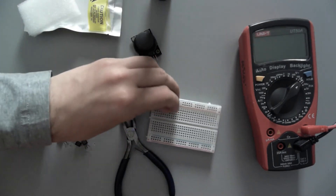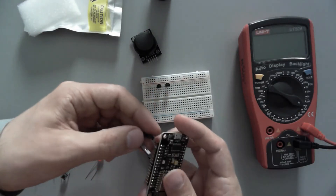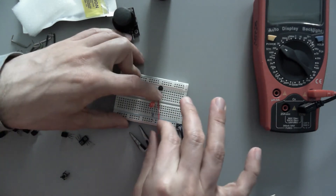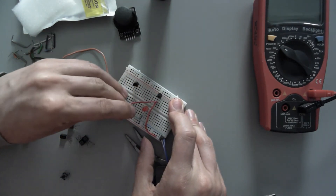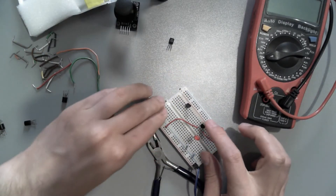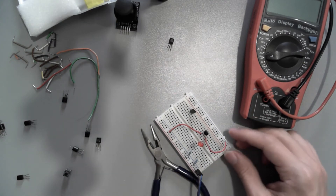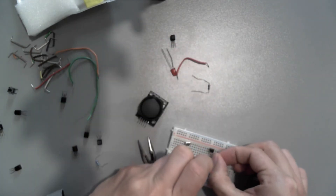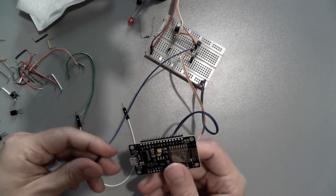Let's get them into the breadboard — those breadboard up rather nicely actually. Got two transistors in, an LED, some resistors, and a power supply at three volts and ground. The emitter goes across there, the collector takes this path down here — should be off — and then if I bring the base high... I made a fairly classic mistake: I had the pinout for this the wrong way up. It should be sensitive enough that I can just touch that, and there we go. Connected correctly now — it goes to zero. That's working.